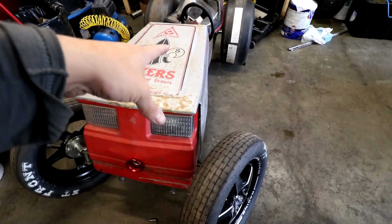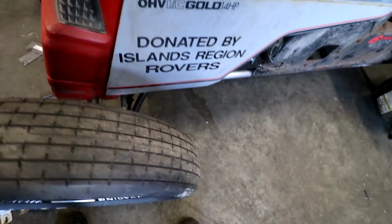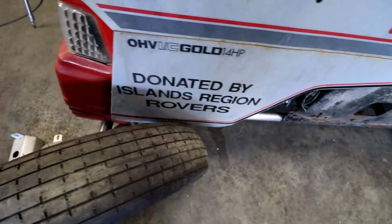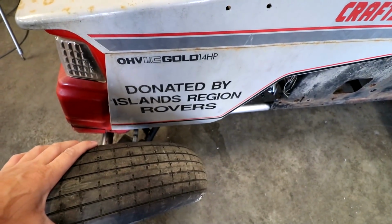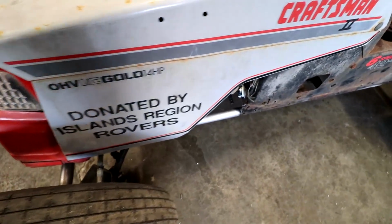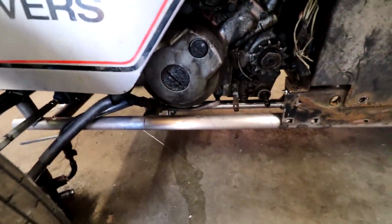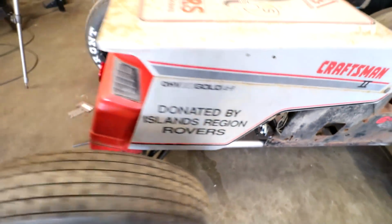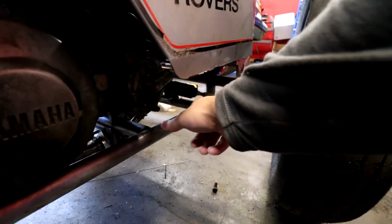Let's get to building. Now we have a couple things to keep in mind when we're building this exhaust. It needs to fit underneath this hood, pretty straightforward. It can't obstruct where this wheel turns. Oh, full lock on this side, it hits the thing, but that's my GoPro. So it's going to probably end up somewhere along the frame here, maybe, and then up and out, because we gotta keep it tight. We gotta have room for everything else. I think there's a water pump on the other side we gotta keep in mind for. That's a water pump right here, so we gotta go down below that.